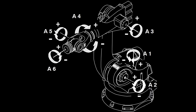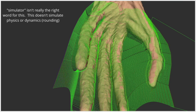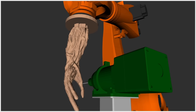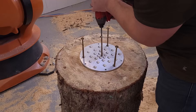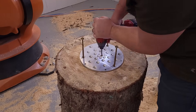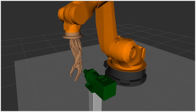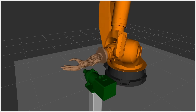Since Freddy has six axes, we need to do a little bit of extra work to make sure that the robot can follow all of the points that the CAM system made. We're using ROS to create a really basic simulation where the robot in the simulation is going to follow all of the points we programmed in our CAM system. For each point in our path, we do what's called inverse kinematics — we look at where that position needs to be in space and the orientation of it, then we calculate the joint angles of all six axes in the robot, and that will tell us if the robot can reach it and if it can do it within its joint limits. Since the screws are screwed into one end of the log, I'm going to try to do all the programming with the log hanging under the arm. That should keep all the force along the screws and should help keep the log or mount from bending, hopefully improving accuracy.